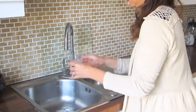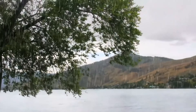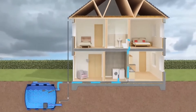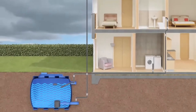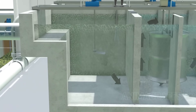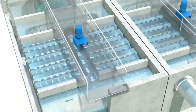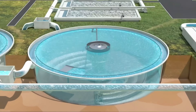If you're using rainwater for drinking or cooking, filtration is crucial. While rainwater is generally clean, it can pick up contaminants from the roof and gutters. A proper filtration system includes sediment filters to remove dirt, leaves, and debris; carbon filters to remove odors, chemicals, and chlorine; UV sterilizers to kill bacteria and viruses; and reverse osmosis systems for the highest level of purification. For irrigation or flushing toilets, basic filtration such as a sediment filter is usually enough. However, if you plan to drink the water, investing in a multi-stage filtration system is a must. With the right setup, rainwater can be just as clean as bottled water.